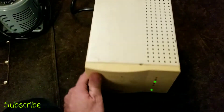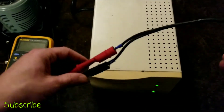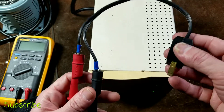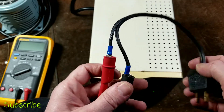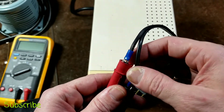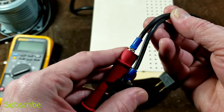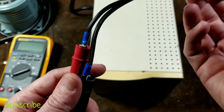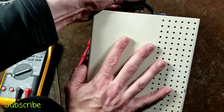We'll turn off the light so you can see the indicator lights on the front. A quick safety note: when measuring voltage on power outputs like these, I recommend you don't do this unless you really know what you're doing. I have what is colloquially termed a suicide cord. The key thing if you ever need to make one of these is to cut one wire shorter than the other so it's very difficult for them to come into contact with each other. I'm also using insulated alligator clips, so we'll be in a pretty safe situation.